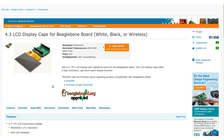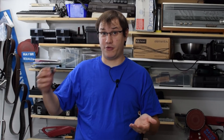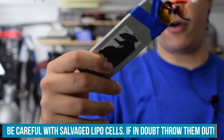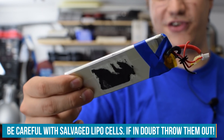You just have to download the pre-compiled image on the website and install it on your device. We also need a sufficient power source, so I have chosen the Adafruit PowerBoost 1000 and a LiPo cell with 3000 mAh — that should be plenty. I salvaged this LiPo cell from an RC battery pack; one cell blew up, another one was okay. Always be very careful with these LCD panels because the connectors can break very easily — the big connector is for the display itself and the small one is for the touch panel.